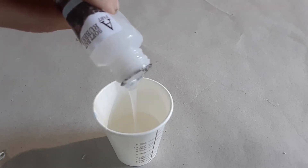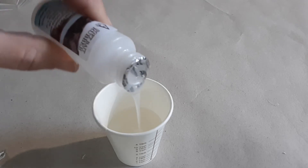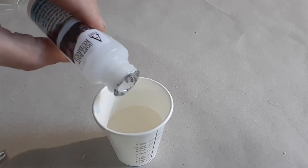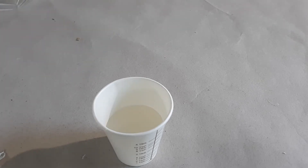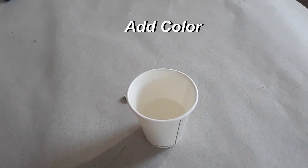As I'm pouring, this is a good time to talk about our other mold making material — the Impressive Putty. Composite mold and Impressive Putty are both reusable and remeltable. I would use Impressive Putty for faster-cure urethanes or slightly higher melting temperatures, and composite mold for clear epoxy resins. Both can be used for other materials, and I'd use composite mold with a plaster additive if I was going to use plaster.